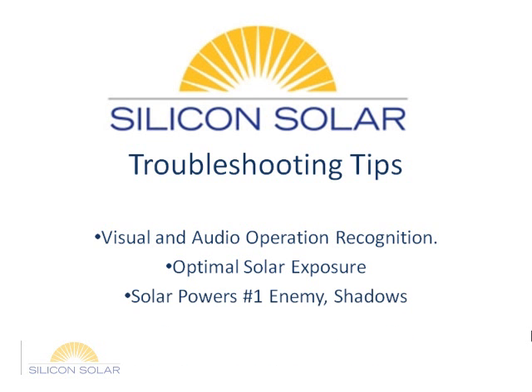Shadows are also a known enemy of solar-powered products. We recommend when setting up your solar panel, do so in the early morning. Then between the hours of 10 a.m. and 4 p.m., check your panel every hour to be sure shadows don't cross it throughout the day. Shadows move 360 degrees around objects throughout the day and grow longer throughout the fall and winter seasons, so we recommend checking the panel on a monthly basis. Shadow crossings on the panel will cease the pump from operating or cause batteries to prematurely fail if your model has a battery option available.